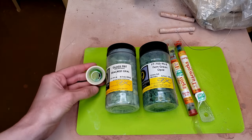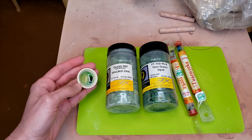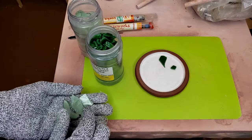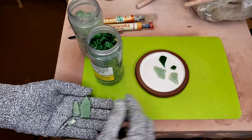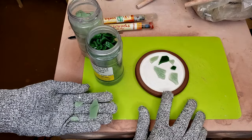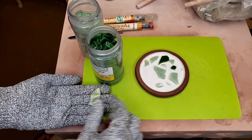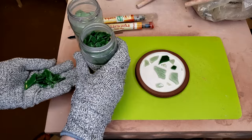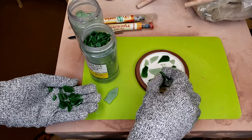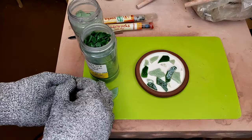I did fire this little test piece here and I put the glass in pretty thick, and it seems to be alright. This one actually had a white gloss glaze on the inside. That clear glaze I applied has dried out and I'm loading these up with some pieces of this glass. My intention isn't to fill it all the way to the top of the rim — I just want enough to get a good coating, maybe a millimeter or so thick. I'm going to fire this to the temperature where this glass actually liquefies.